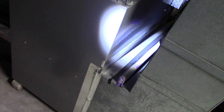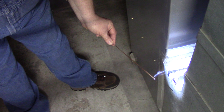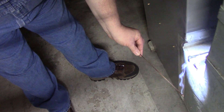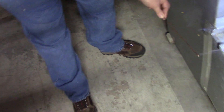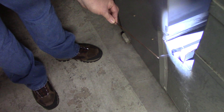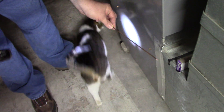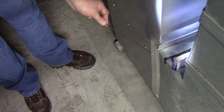My lovely wife came up with the idea of, since I don't have a smoke stick, we're going to improvise with an incense. Think about it — you want to pull air through the house, but look how it's just sucking the smoke in from the incense through there. It will go on this side of the filter which will pull air from the house, but look how much smoke we're sucking through on the non-filter side, because remember this is the ductwork here and this right here is your blower. So how much do you think we're bypassing that filter and still having airflow?